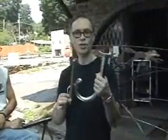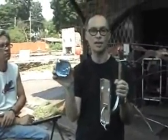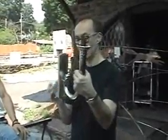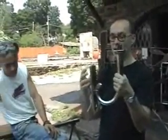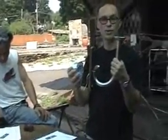The whole issue is that this is a French sconce, which like a lot of antique sconces, the back plate is very narrow — it doesn't meet code. The code requires the gem box on the wall to be a certain width. They are narrower boxes used for switches, but once it's the full width it actually protrudes. So I've designed a plate with a step detail that Ray is going to make, plated in satin nickel, that will hide this box.